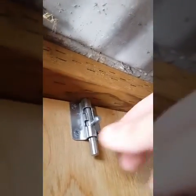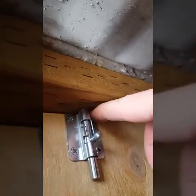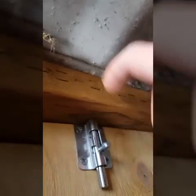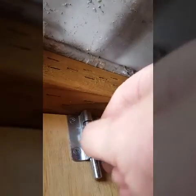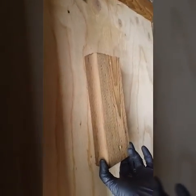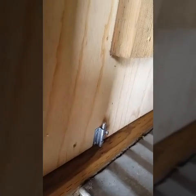And then to make your latch holes, simply take a pencil, once this is in place firm, and mark around the latch onto the frame wood. And then drill out your holes, and you'll have functioning latches. Use the remainder 2x4, attach it to the center, becomes a handle, and just use your measuring tape to make sure the latches are level.